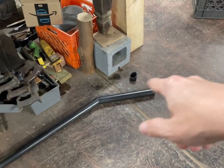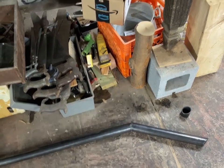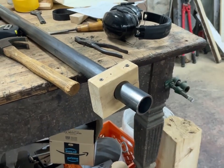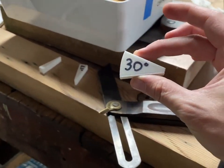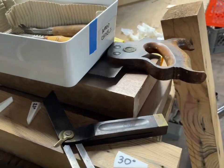I started making this cut outside with the angle grinder. I made these little pillow blocks to hold the pipe so it wouldn't roll around — I thought that was quite smart. I also 3D printed these little angle blocks so I can accurately set my bevel gauge and mark it with the soapstone.